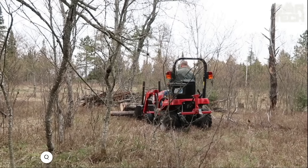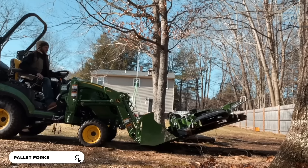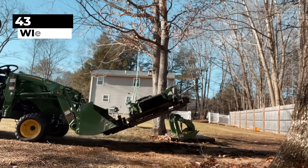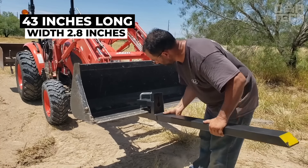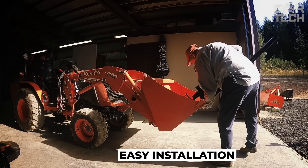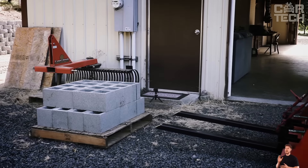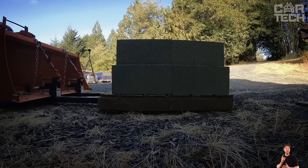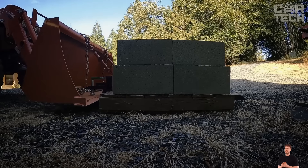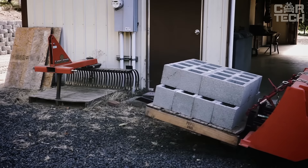The Best Equip Forklift for tractors can lift as much as 2,000 pounds and fits almost all forklifts and tractors. The forks are 43 inches long and 2.8 inches wide. Installing it is a breeze — simply insert the forks into the bucket and tighten the screw. The forks have special chain holes and safety slots so your load will be secure while you work. Made of welded steel with a powder coated finish, it will not rust and will serve you for a long time.